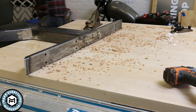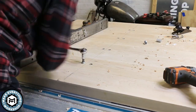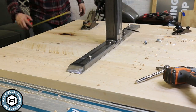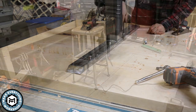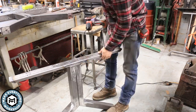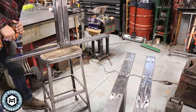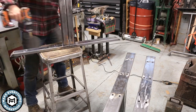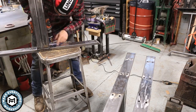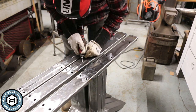It's very important not to drill through the table, so I had a little blue tape flag on the drill bit as a depth stop. Once I get all my screws and anchors set, I can get an idea of how the table is going to sit together. I go back and drill out all the holes in my legs a little bigger — this also gives the wood a little opportunity to move without being bound up by the steel itself.